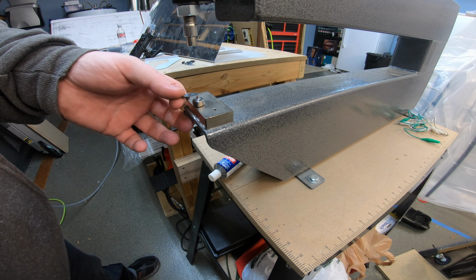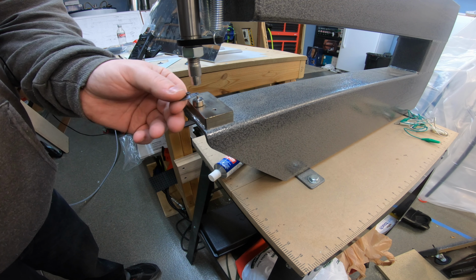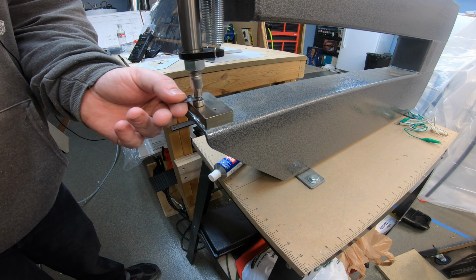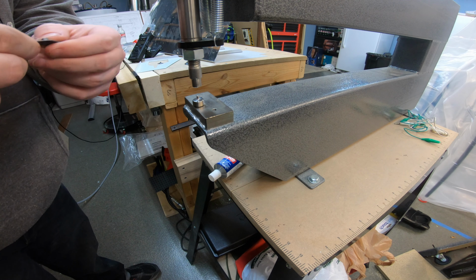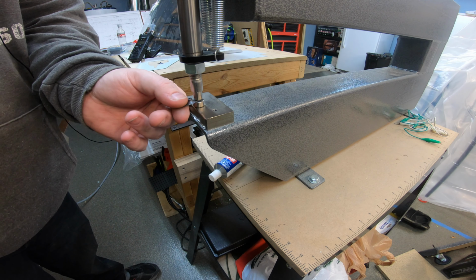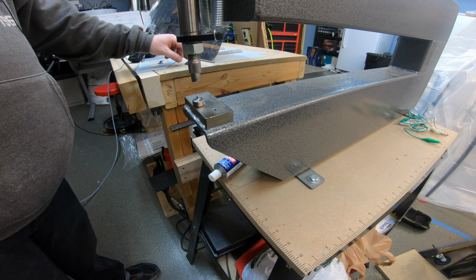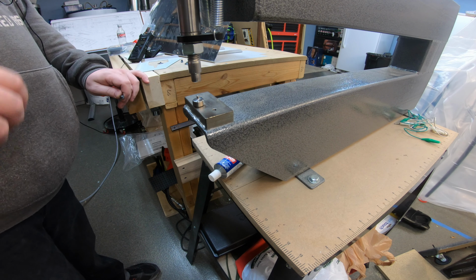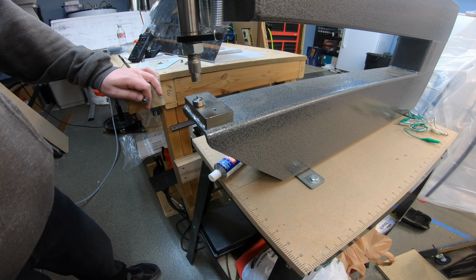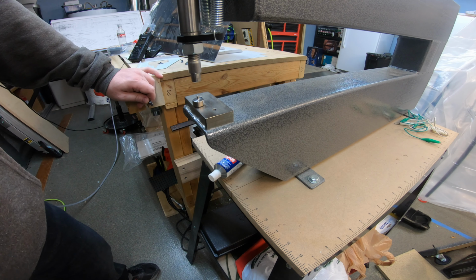But for this, I happen to have the DRDT2 dimpler. So you'll see as I get the plate on here, you're gonna get just a little bit of a bend and then it kind of re-straightens. And that's kind of where I stopped. So it's not maybe a full dimple, but it'll be enough to seat itself into the dimpled holes that already exist. And once these are done, rivet them onto the trim access panel, and then I'll back rivet that panel or reinforcement plate to the skin as well before bending the trailing edge.